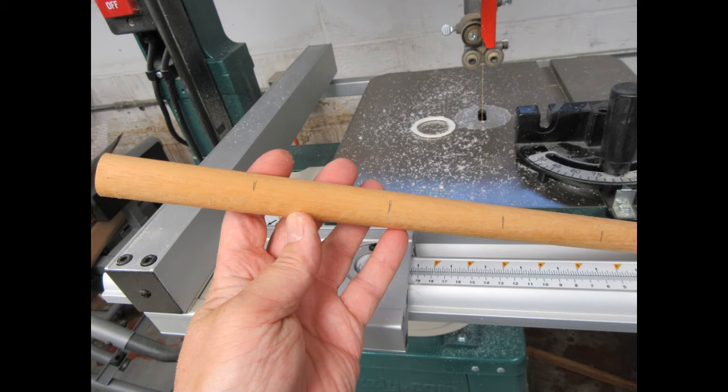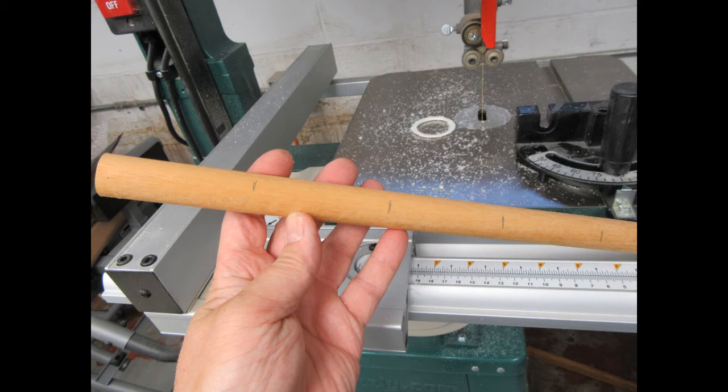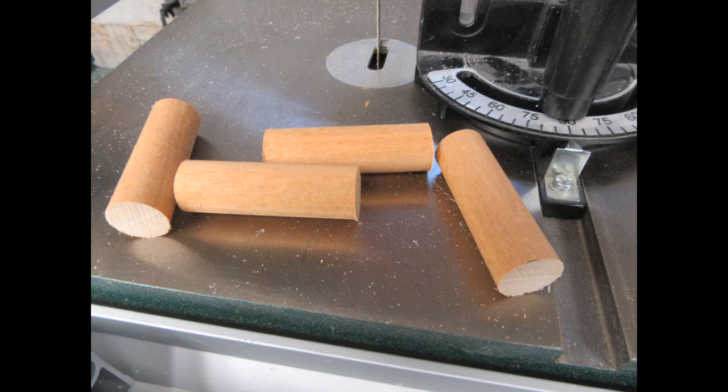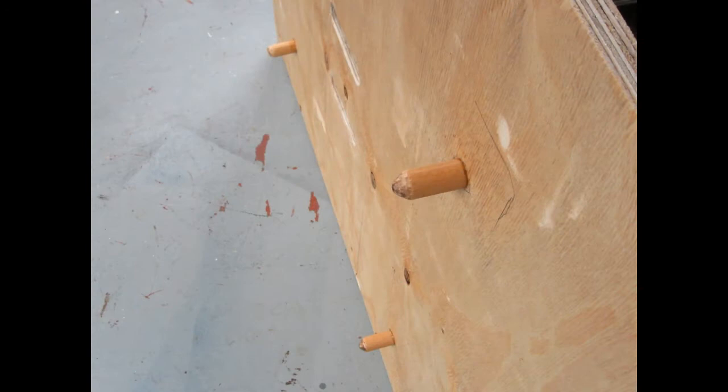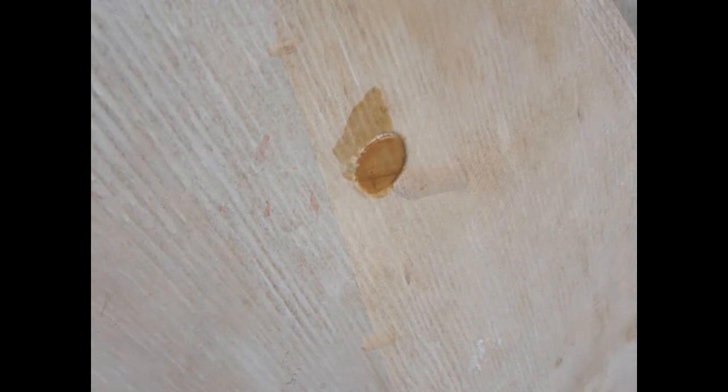On the seven-eighths-inch diameter dowel rod, I marked for the four pegs, used my saw to cut them, and used my belt sander to round one end off so it would fit in between the lattice work on the crates more readily and help align itself upon insertion. I then used epoxy to fix the four pegs into the holes drilled in the earlier step.